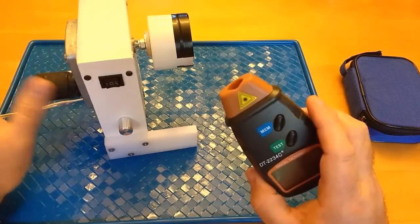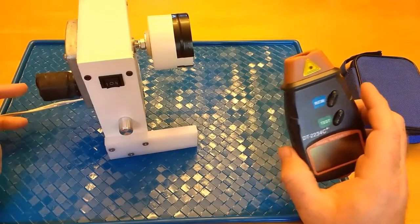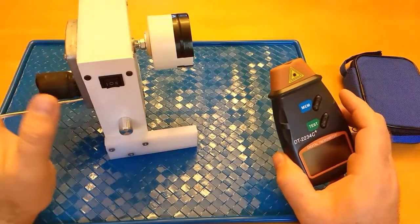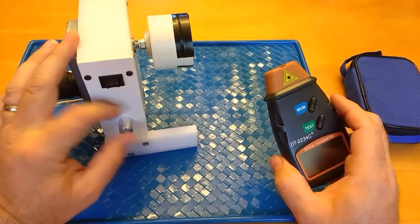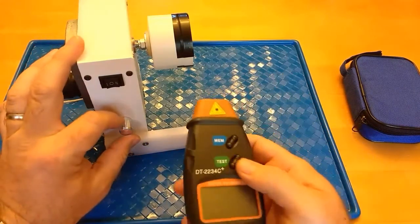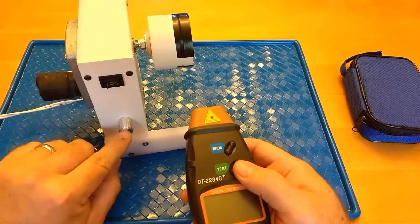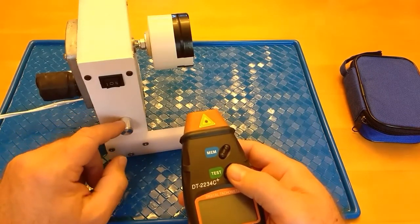So most of the motors that are rated at a certain RPM max, that's going to be pretty accurate. But just say you want to find a setting on your dial and mark it. Just say I wanted to find 25 RPMs. Well, I can check using this tachometer, and I can note the position. You probably can't see it, but there's a little indexing mark on the knob.